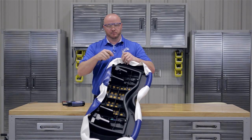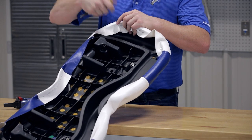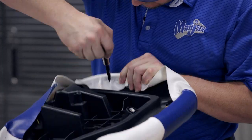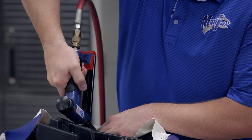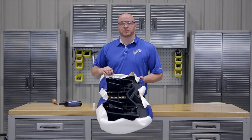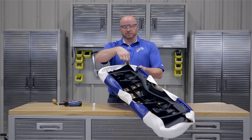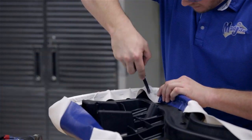Now I have a staple that's causing a big ripple, so I'm going to pull this staple out of the corner, shoot it just off to the side, and pull some more of this fabric out. This fabric is very flexible, so if you need to, do not be afraid to apply extra tension. On the sides, I usually apply more staples due to the extra fabric and the curve of the cushion. Now we're going to move to the opposite corner — again, pull the big roll first, which will create two smaller rolls, and work those out just like we did on the opposite corner.